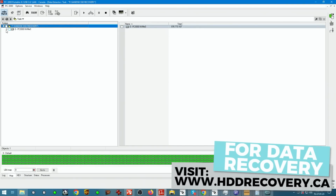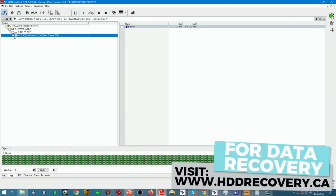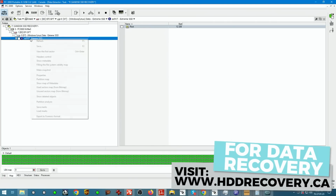Dealing with the structure here would probably be the best thing, because if the unit is not full, we don't need to image blank space. It's an Extreme SSD is what they call it, SanDisk Extreme SSD. Even though it does come up as a Western Digital unit, Western Digital acquired SanDisk, so it's not surprising that we see those names. Use sector map is what I'm interested in.